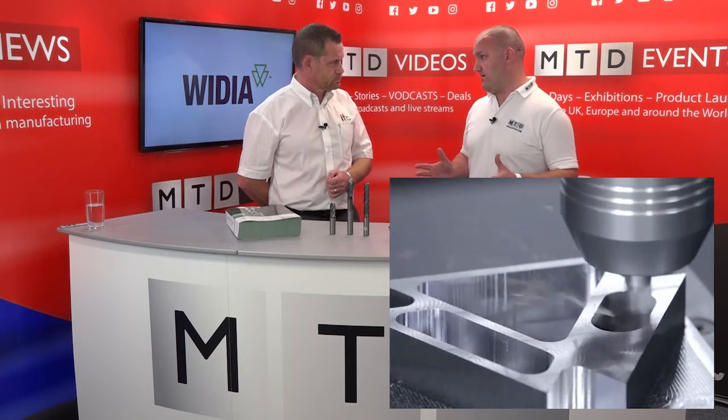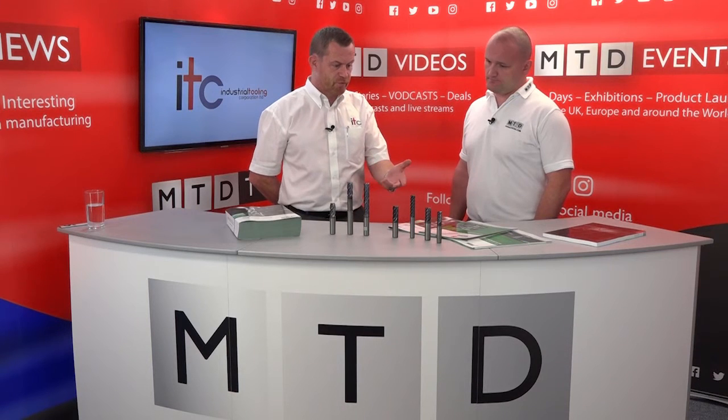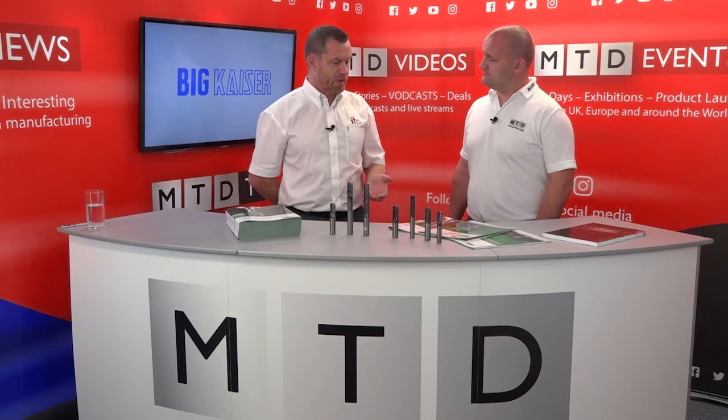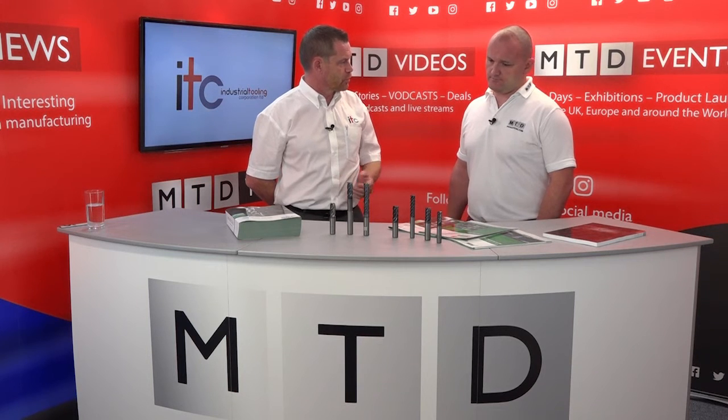It's a big growing area — not enough people apply this technology still, but it is growing. Is this down to the CAM companies? Yes, the CAM companies are coming forward and offering trochoidal milling methods. What Widia have done with the range of tools is combine that with a catalogue which explains the methods, how the tools work, and how to get the best from them. Many tooling companies nowadays proclaim they have tools for trochoidal milling but won't offer technical data. In the trochoidal milling catalogue it gives you data for both conventional milling and also, if you want to use them in the trochoidal method, it gives you actual speeds and feeds data, sizes of cuts, and step overs required for trochoidal milling programs.